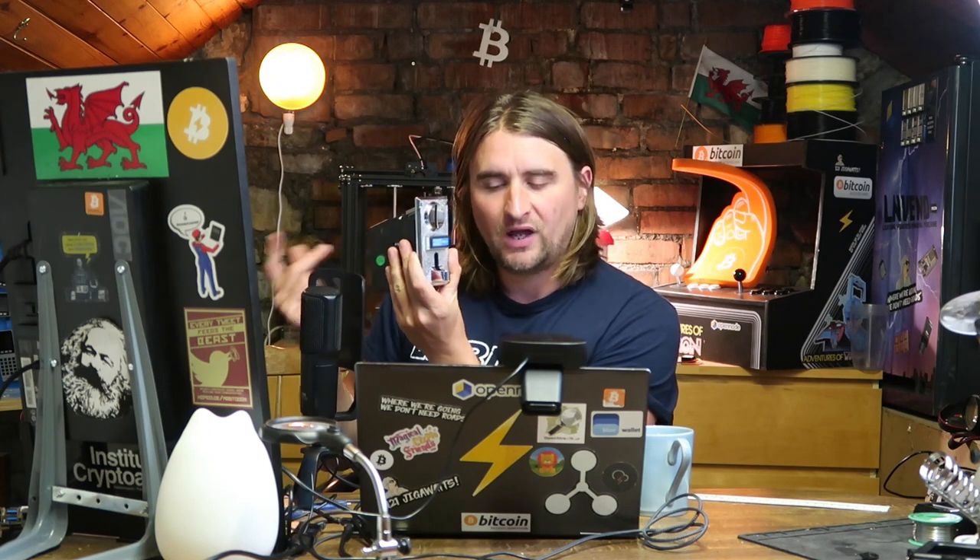The biggest issue I've had has been the coin mech. This is the coin mech I was using, and the way it communicates to the ESP32 is when you drop a coin in, it sends pulses. But occasionally, electrostatic stuff or someone with a magnet could trigger pulses. I also found it tended to clog a little bit too much when out in the wild and it kind of needs someone to babysit it.